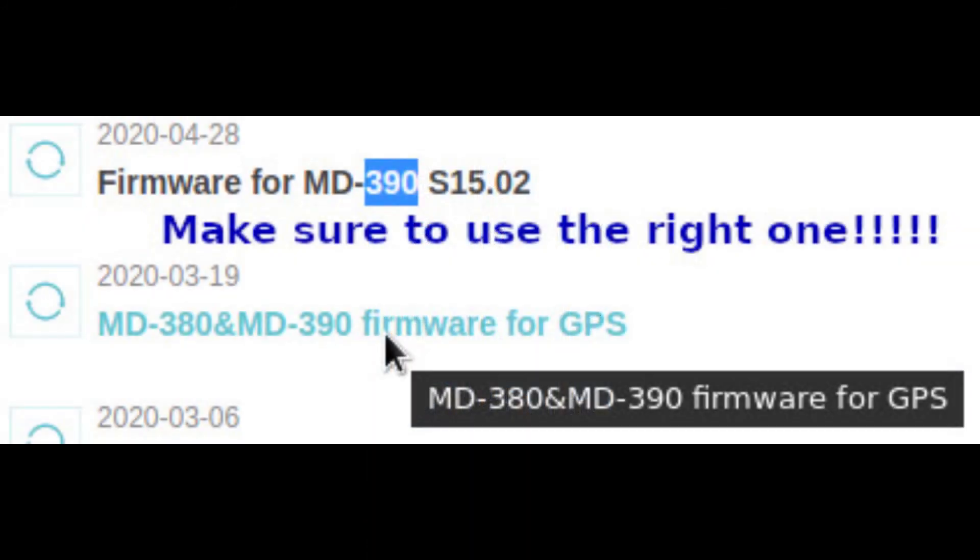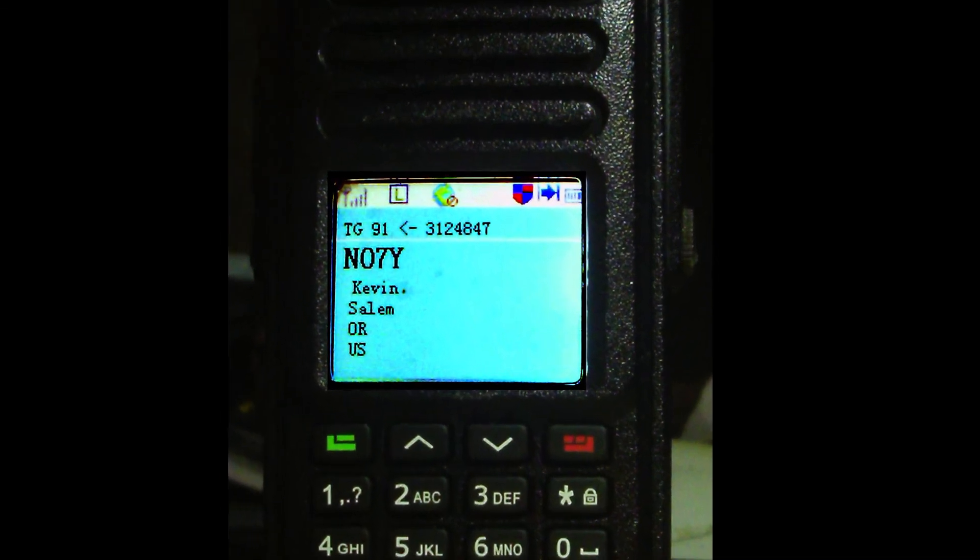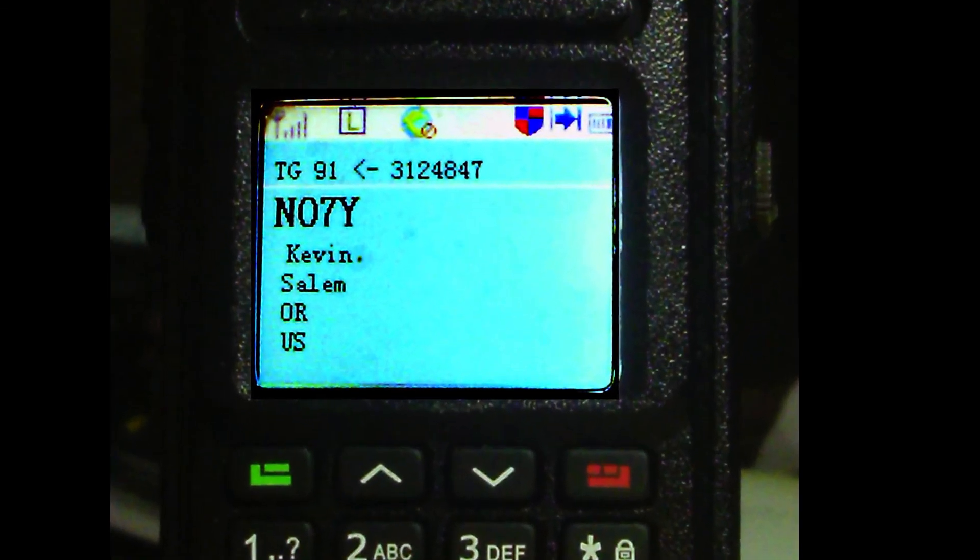The radio is neat in that you can load two different major firmware types from the manufacturer: one that allows you to record audio, and another that allows you to have up to 100,000 contacts, letting you download the DMR database to show call sign and city information. When updating or changing firmware, make sure to follow instructions to a T — a goofed firmware can mean a destroyed radio, use at your own risk. I found the firmware at Radio Oddity, link below. I loaded the extended contact firmware to see call signs, and EditCP can then load the contact database automatically.